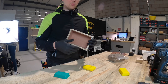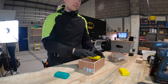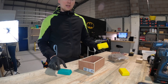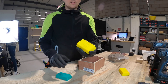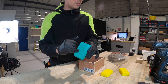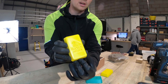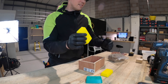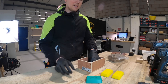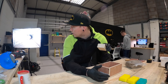The oil helps it not burn and stick together — you can press it. My plan is to normally use talcum powder across the top of an open mold, but I'm going to try putting the sand in and then hammer down the molds into it, use the finger holes to pull it back out. I'm going to try and do two at a time: one is a raised logo, one is a sunk logo, and then one which I don't think is going to work is a sunk logo with my writing on as well. Quite a lot of detail. I'm going to get the sand out and compact it in here.